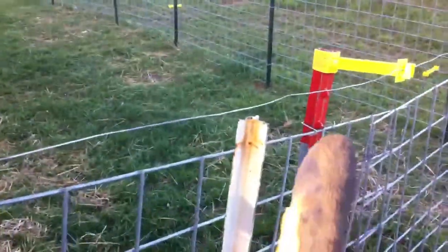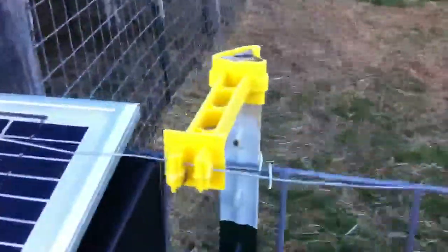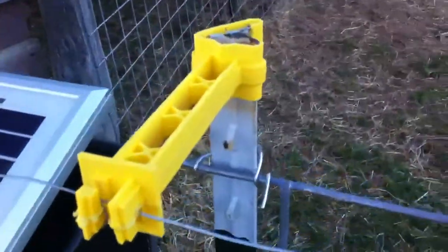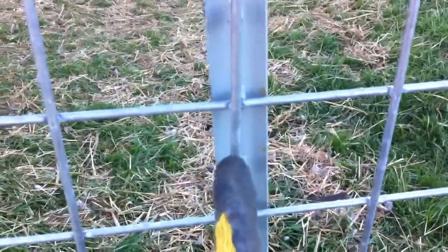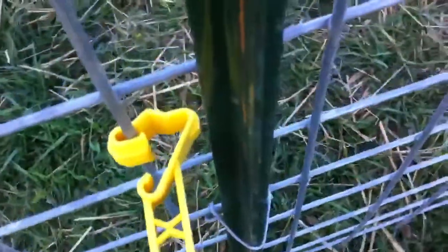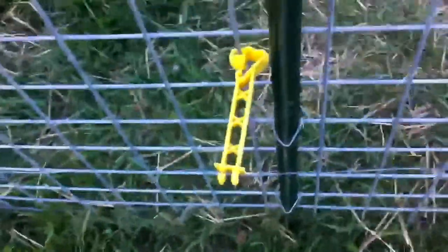This electric fence is two layers. The second layer is about knee height. I thought I wasn't even going to be able to do the second layer because when you get to the bottom, some of the fence parts are in the way and it makes it impossible to attach. But when I looked at the extra bag I bought, it turned out to be an inverted T-post bag — I got the wrong one, but it worked out because the way these clamp on, they can actually attach to the quarter-inch metal we have for the fence. It saved me a trip and let me complete it today.